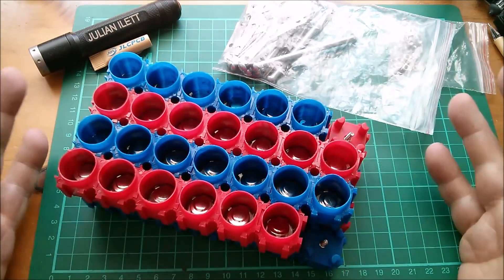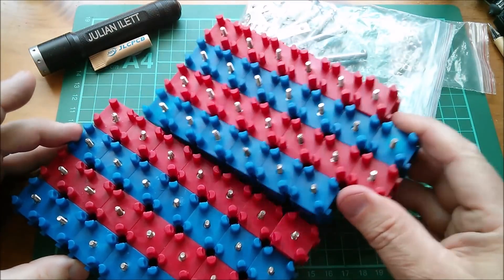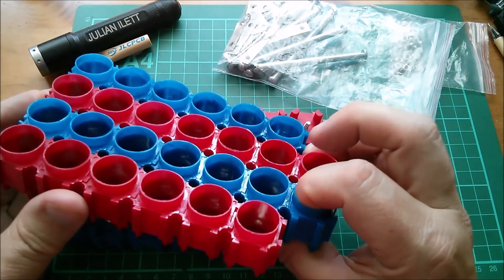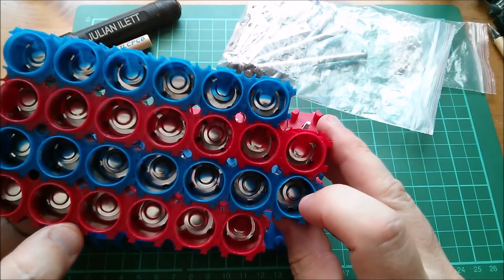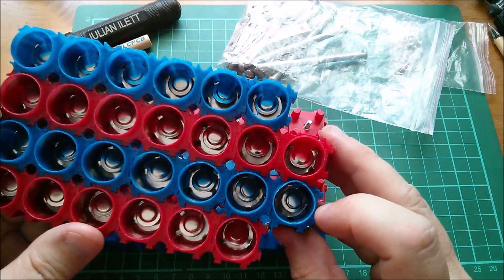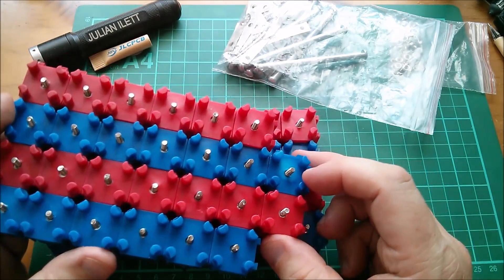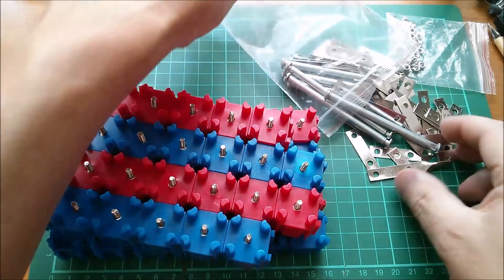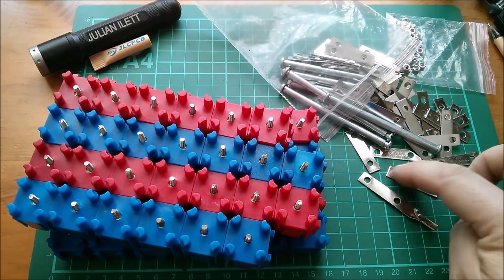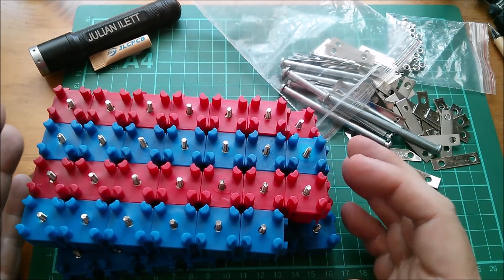Let's take a look at how this system works. It's based around these plastic end caps — this is one half of the set I bought. They have little springy, quite strong spring terminal connectors which push onto the end of the battery. It's the same at the positive and negative end. I use red for positives and blue for negatives. There's a brazed-on stud here which you can put nickel strips over. These ones are special wire connecting strips, but there are lots of these two-hole nickel strips. You can put them in horizontal and vertical configurations to make up your series parallel connections.